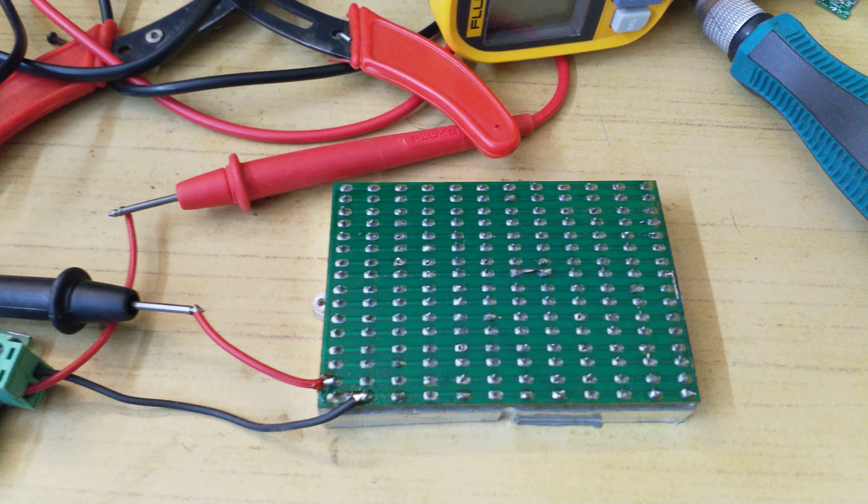The coil whine is really annoying. I was thinking of using it, but unless I do something about it, it's going to die if I use it continuously. I'm not sure how many LEDs are affected — only a few blink but others might have a very short lifespan. The only real options are to throw it away or attach a current limiting circuit, but then you're better off with something else entirely.